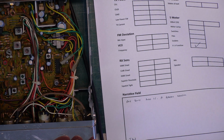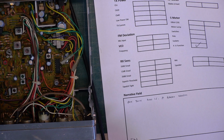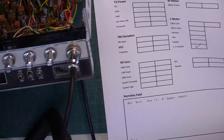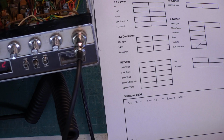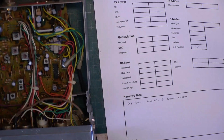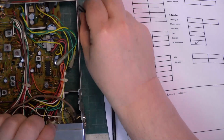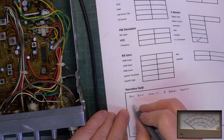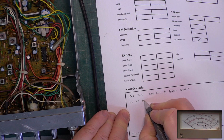So we put in the correct frequency, 27.79125, into the signal generator. I can actually hear that receiving at low strangled volume. And we can see, hopefully, the meter reacting. So we've got no received audio. I wonder if some Wally's rewired the mic. Let's go into transmit. I'll put picture in picture on. Look, we've got transmit. So, no RX audio.